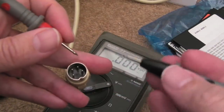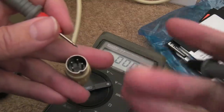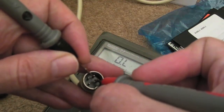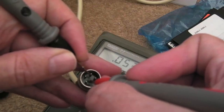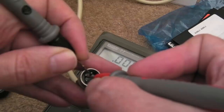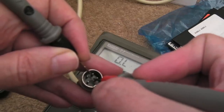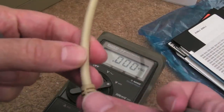I'll try to show you this. The top right pin is ground, and then you've got 5 volts and 12 volts. I'm measuring 3.7 volts there - that's why it's not booting. And there's no 12 volts either - reading 0 volts and 0.4 volts. So yeah, there's a problem with the 12 volts. It could be this DIN connector - that's one possibility.